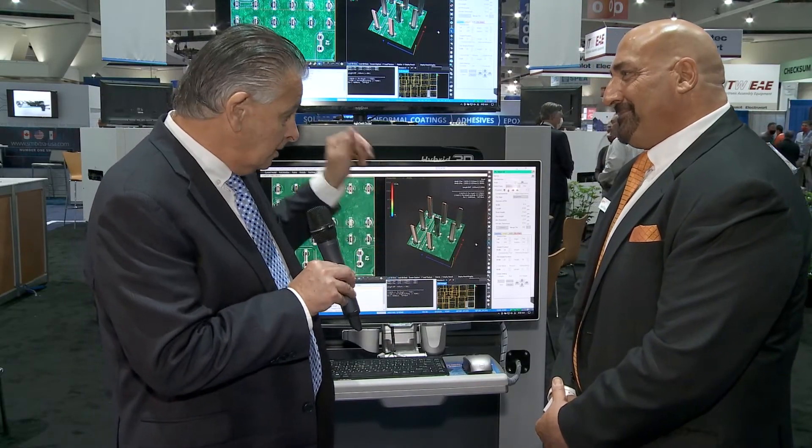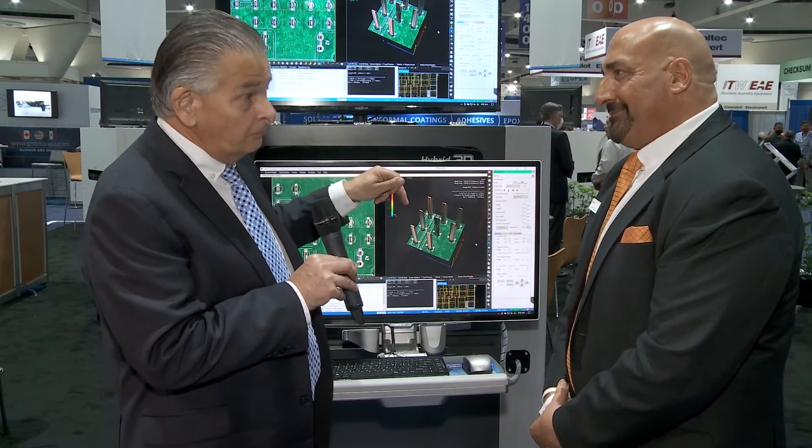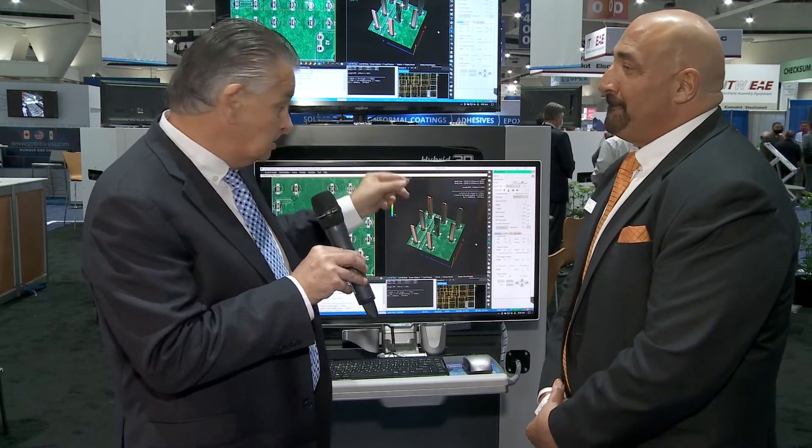We could also put a 25 megapixel camera on here, getting it down to about 6 or 7.7 micron accuracy. It's pretty resolute — pretty darn resolute. That's pretty good. The things we're inspecting for are planarity, presence of a pin or not, and the distance between them.